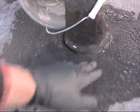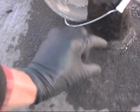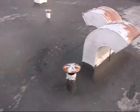This is zero. I'm going to cut that down flush with the roof. Oh, that looks real good there. I'm going to cut that flush with the roof. And my 2x4 is going to start here at the thinnest, zero. And I'm going to build up to a midpoint, which is probably 15 feet, 5 meters away, right there. And here I'm going to be a foot high, and it's going to pitch gently, not a lot, because I don't want to have the roof too high. It's going to pitch to that drain. So it's going to start from zero, rise, and then when it hits the midpoint, start descending, and it's going to drain to this drain, which is conveniently right next to my ventilation system.